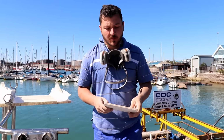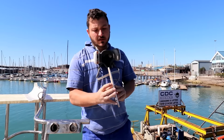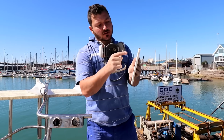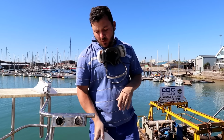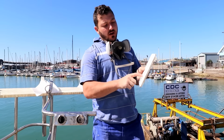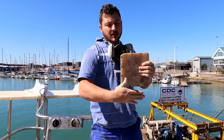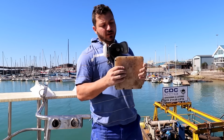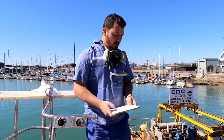So out of an old piece of fiberglass that we found lying around, relatively thick, about 10 mil thick, I'm going to use it as a backing plate now. So I'll drill the four holes. That'll be our new backing plate. There was wood on this one, actually as a frontal plate, not as a backing plate. So the stainless steel bracket will now mount onto this. This will mount onto the boat, and then we'll have another glass backing plate and then fiberglass washers with the lock nuts. Everything composite, less maintenance, and I'm happy with that.